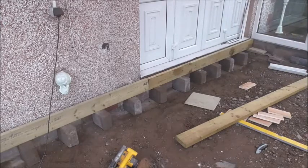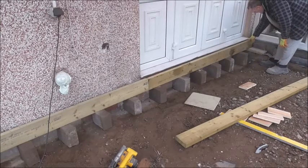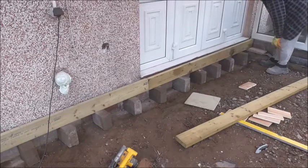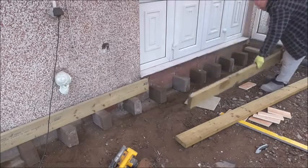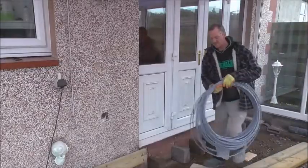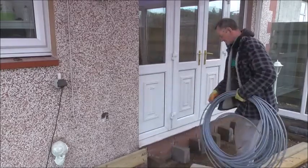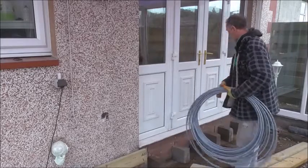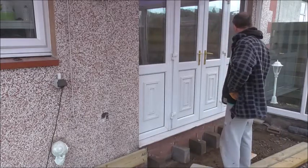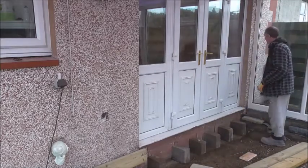Okay, that's all then done. Now then tight to this point, I will have the pipes coming through the wall. And that'll be in the way. So before I put these in place, I'm getting pipes in first. Now I've got here some 10mm microbore. You can run two vents through, two radiators in the house. Not connecting anything up yet obviously, so getting laid there is adequate, but the main thing is to get them through this wall, which is as tight in here as possible.